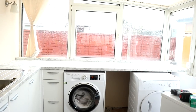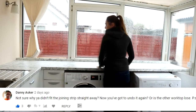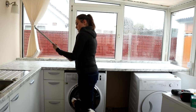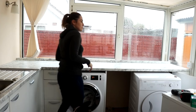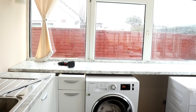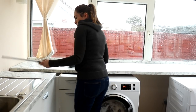During my sink fitting video, Danny Asker left a comment saying he wasn't sure why I didn't fit the joining strip straight away, since now I'd have to undo it again, or asking if the worktop was loose. And yes, he's quite right — that's because the units are actually taller than the windowsill and this was the only way we could get any worktop space. Next week I'll be showing how I fitted the lip at the back and covered up an awkward bit at the end. I had just enough space to work with; otherwise in a regular room I would have fitted the long piece first and then worked my way around.